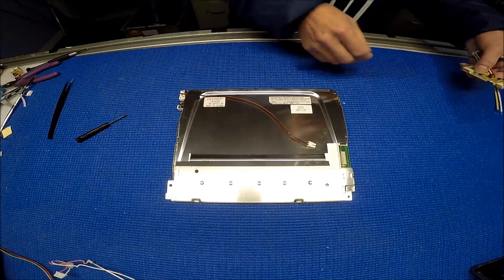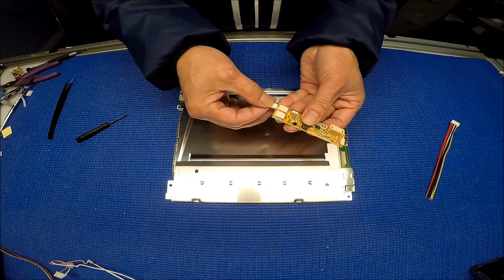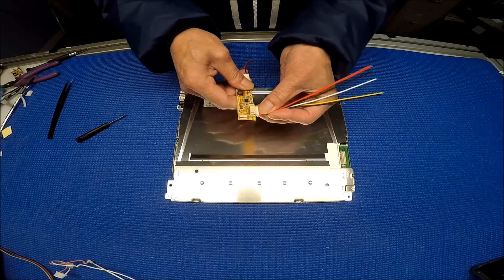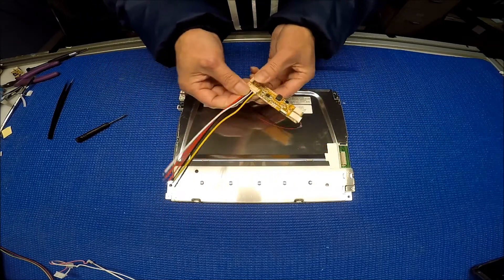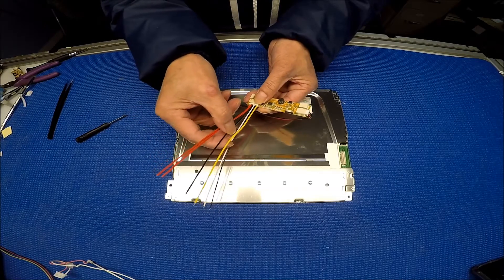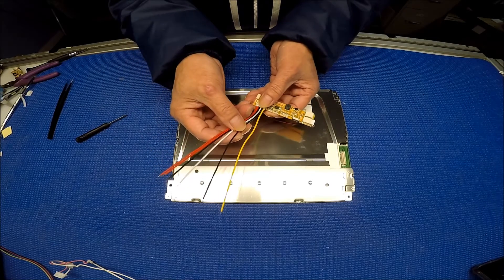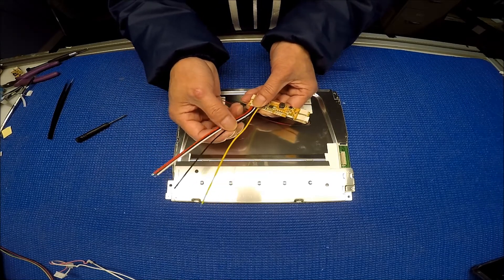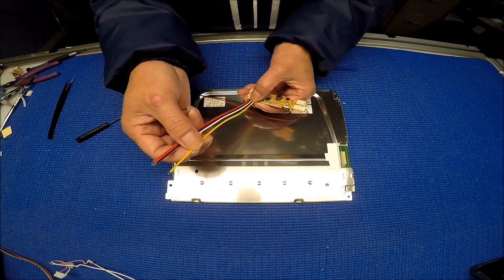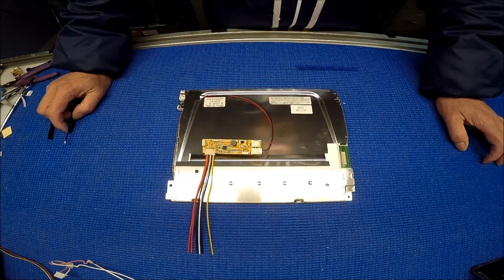Almost done. This LED strip can connect to either one — connect to this one; you can mount it anywhere, just use double-sided tape on the bottom. Red wire is for input voltage or positive. Black wire is for ground or negative. White wire is for brightness adjustment — usually there's no connection. Yellow wire is really important: it's the enable signal. You apply anywhere between 3 to 5 volts and it's going to turn this driver on and off. Thanks for watching.